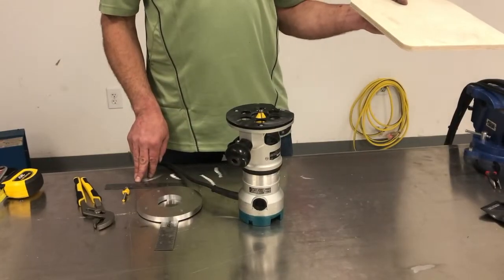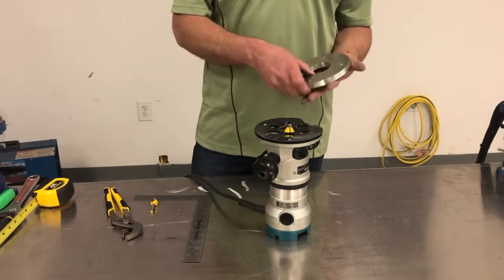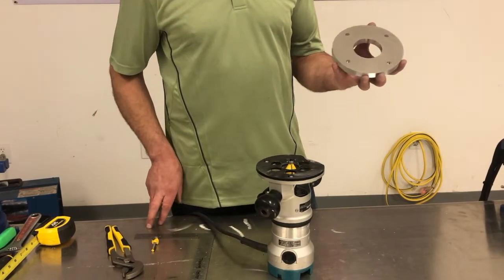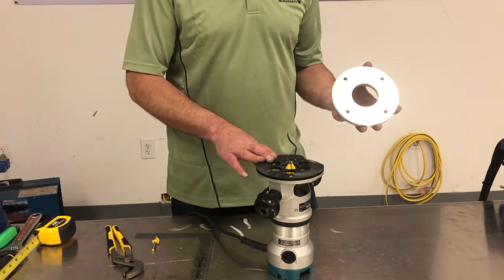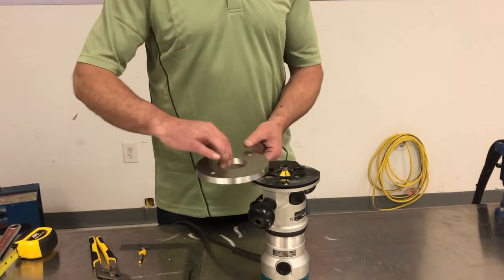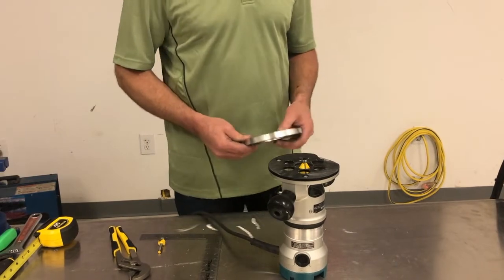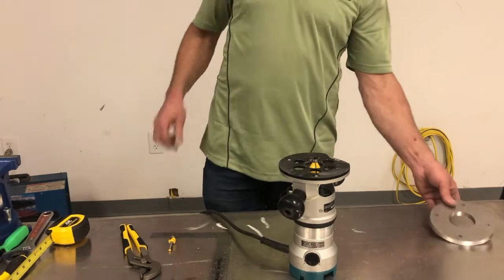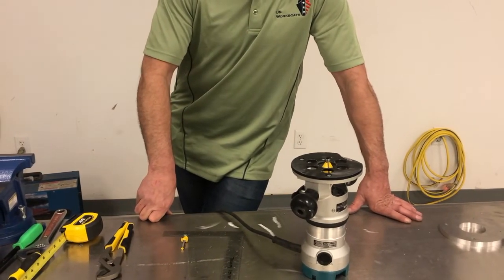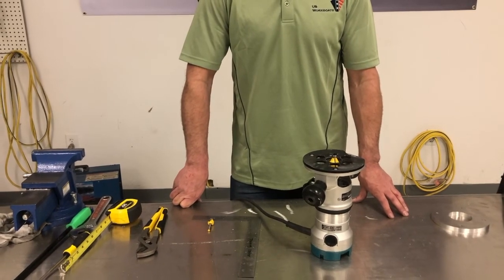That's about all that tool does, folks. We can obviously cut wood with a router — it's actually designed for wood — but the main thing I'm talking about here is aluminum. I've also talked about holding pieces down; if a piece is hard to clamp, you can either weld it down or secure the router to a table. With a handheld piece you bring it in and down into the machine and work it that way. There are obviously lots of types of routers, and we do have a big CNC router as well, but this is just the simple little handheld tool. Let's not break the base, let's be safe, and let's do a good job. Thanks for watching.